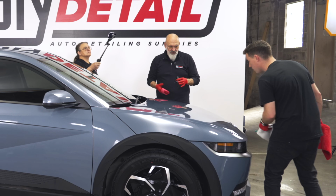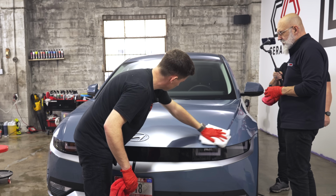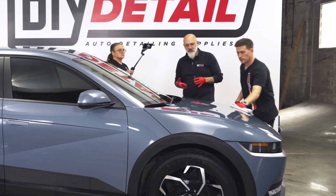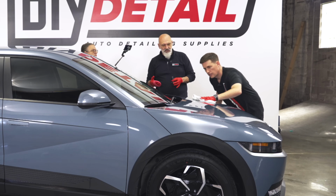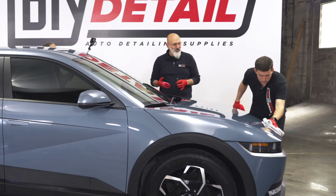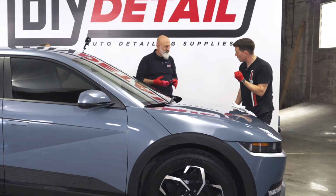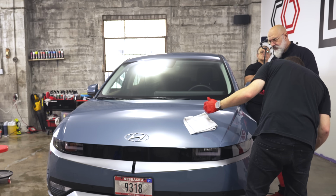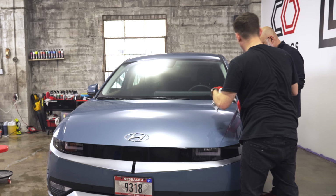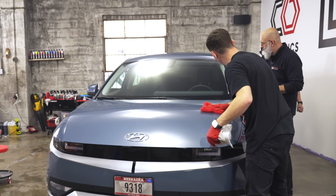Right, and you're ready to wipe? Okay. Ready to level. Boy, humid is different. Humidity is the bane of coatings. Humidity helps the cross-linking. As you can see, it speeds it up. But it does feel a little grabby under my towel, and usually we say if it's grabby, it's too soon. But we're watching it flash, and it's like, no, it's ready. Yeah, it's very strange. So weather can have variables, even indoors.